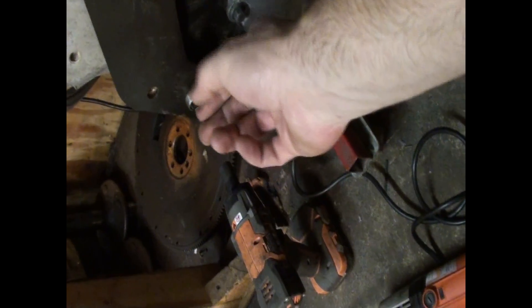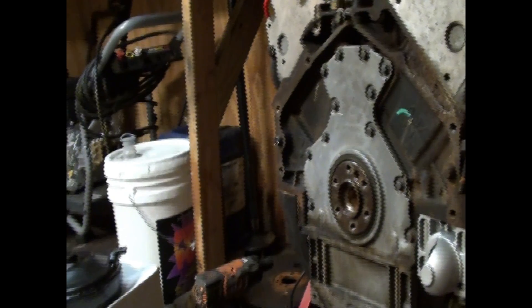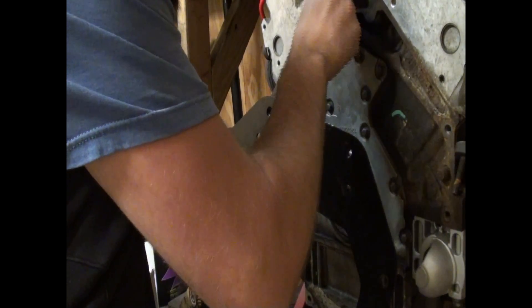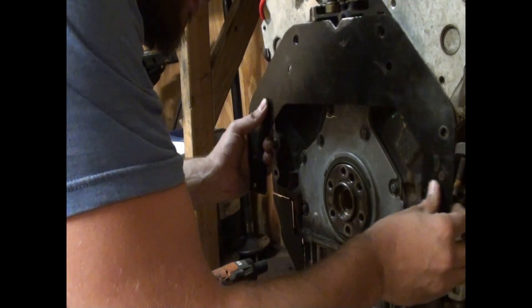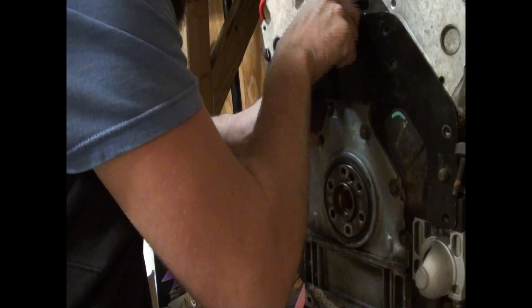Little recap: I use a 12mm socket as my dowel pin. I ground out the boss, then welded on a nut so it would fit without an issue. This is like a TCI adapter plate, I believe. The adapter plate side of it's done.